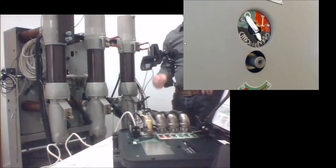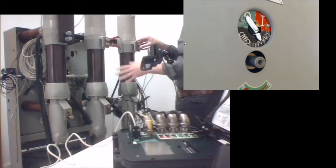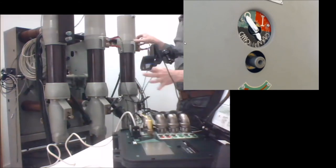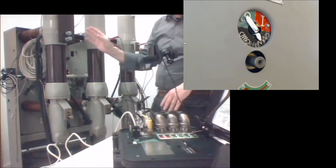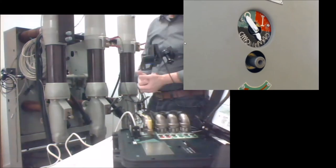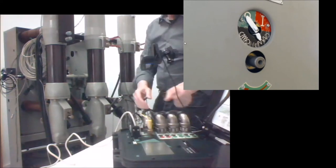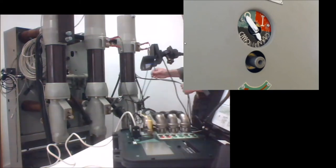These are the main contacts connections. Two of the phases are already connected to save some time. And there's one phase left that I'm going to use to show you how to connect the pairs of terminals coming from the main contact and contact resistance multi-connectors. So basically, what I get from those multi-connectors are these three pairs of contacts.